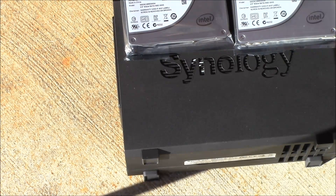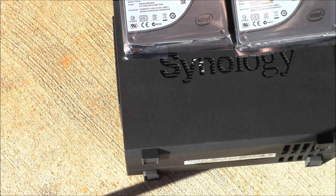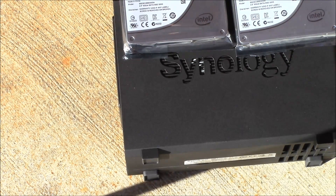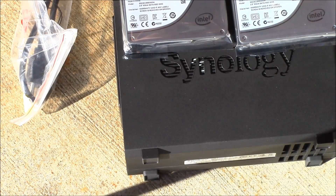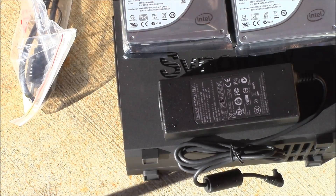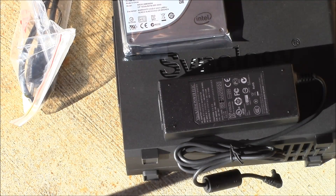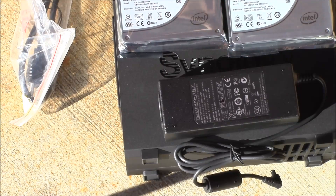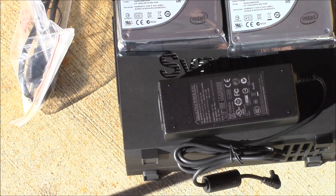When they power down, that'll save about 10 watts on every drive. Right now it's using about 60 watts, and if they're all in hibernation I think it drops down to 20 watts. So that's my plan. The power supply is DC output 12 volts, 6 amps, but I think this unit is only specified to take about 20 watts. The drives use around 10 watts each.